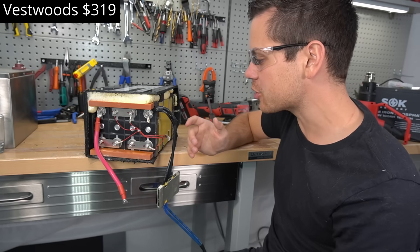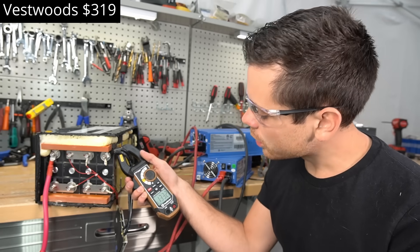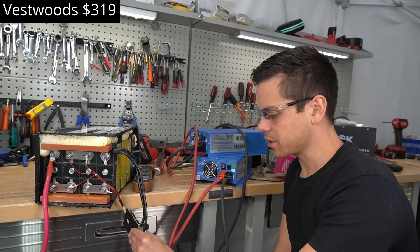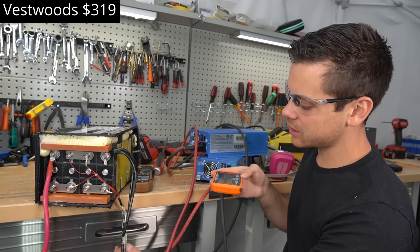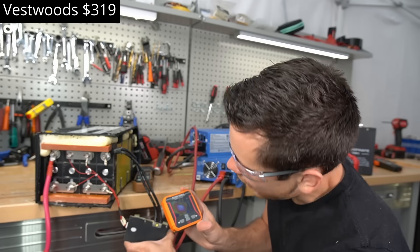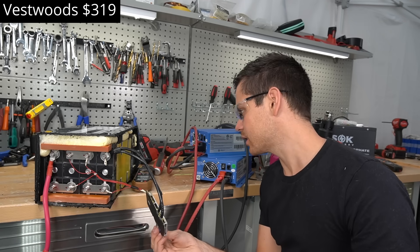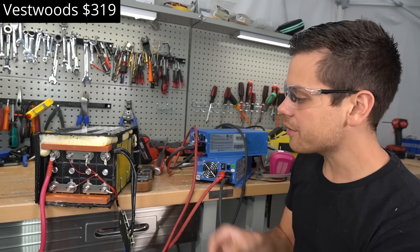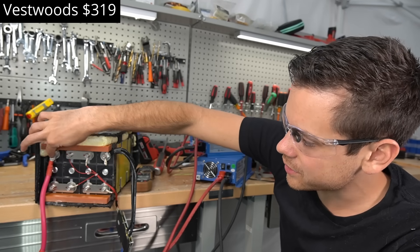For $320 it's actually pretty good, so let's try 100 amps. It pulled 133 amps and wasn't that warm. Using a thermal camera for a closer look: 137–138°F on the BMS side, and the solder joint reached 125°F — not bad at all. I was totally wrong — this thing can handle 100 amps, and it has fiberboard for thermal protection. If it had low temp charging protection, this build quality at $319 would make it a really nice battery.